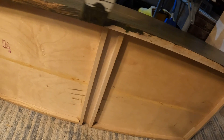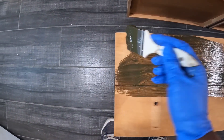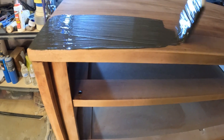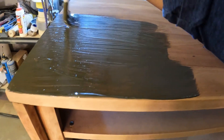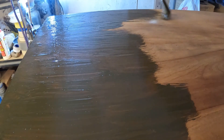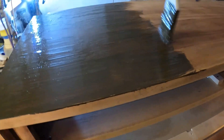I put it on, then about 30 seconds later rubbed a small piece just to see what it looked like. Then I put it on again and started working on another dresser drawer. When I saw that it wasn't going to stick too hard — because I wanted to be able to see the grain — I didn't want it to be too heavy. Some stains just kind of cover up too much. I wanted more of a natural brown without having that orange in there. There are different types of wood on the piece and I just wanted it to show whatever it is.